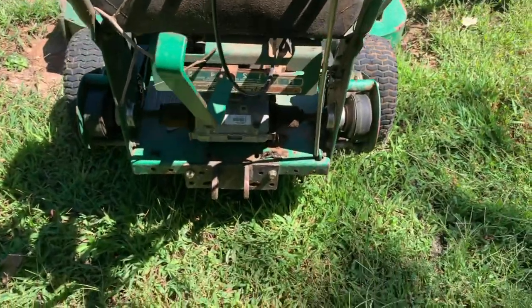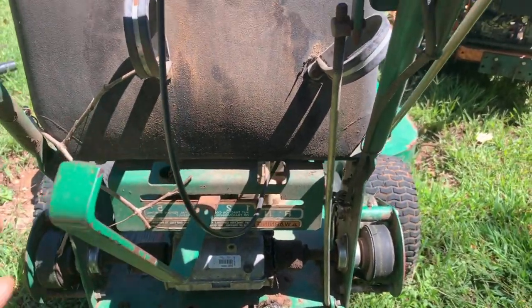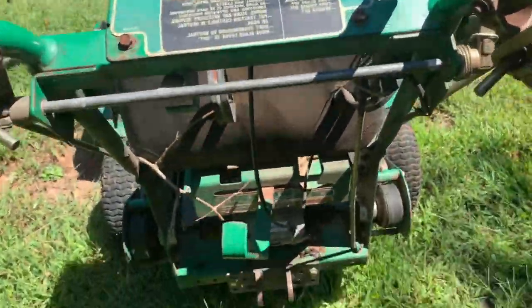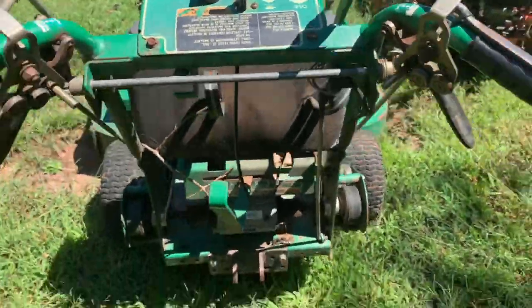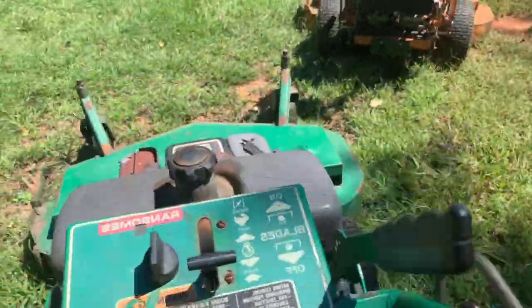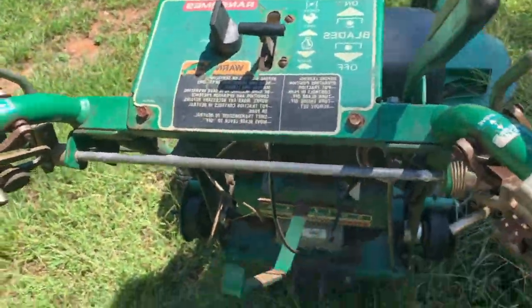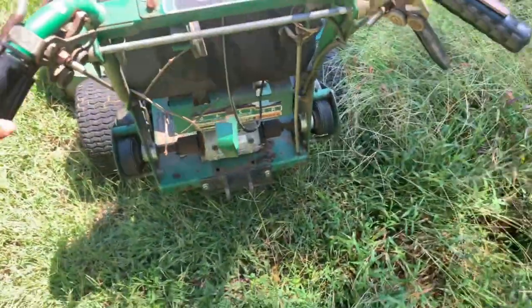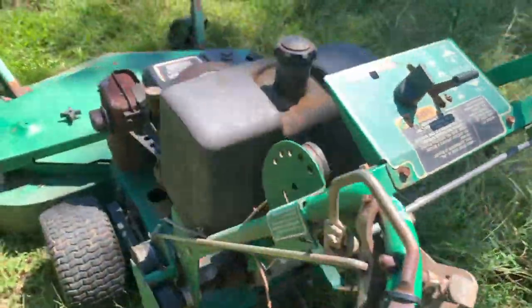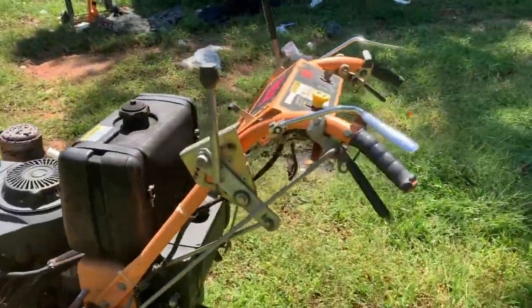With the Bobcat there is no parking brake. Usually when I load it onto the trailer I put it in gear so it ain't gonna go nowhere. But put it in neutral and it'll roll — prime example, going downhill it'll roll. So make sure it's in gear. With the hydro you don't have to worry about that — she is not moving.